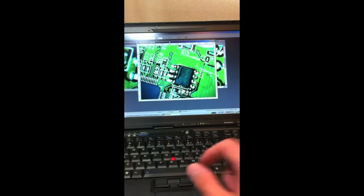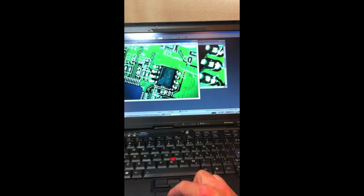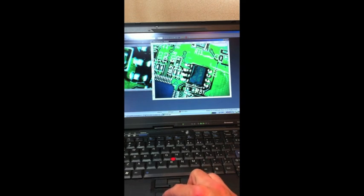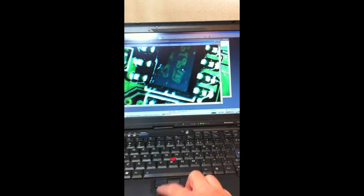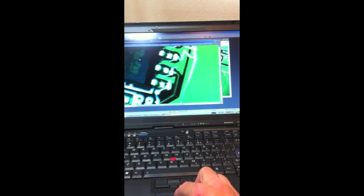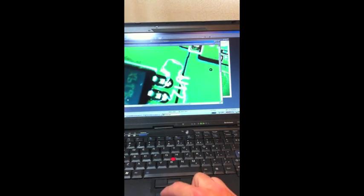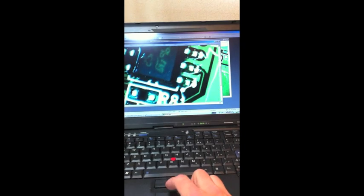One other thing to note: when I come back to my solder station and put my chip back on, I have better definition inside the microscope than what you actually see in this photo. The photos coming through the camera aren't quite as good. In the previous photo you can see those rings around the edges — those rings are the flux. That area is what the flux looks like when you actually touch it to the board, and that was just a very tiny small amount.